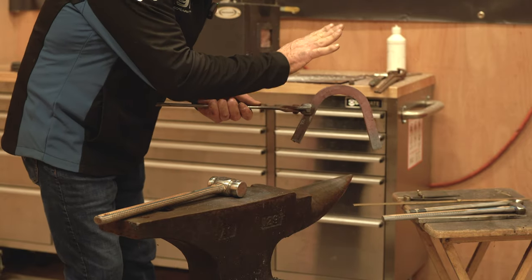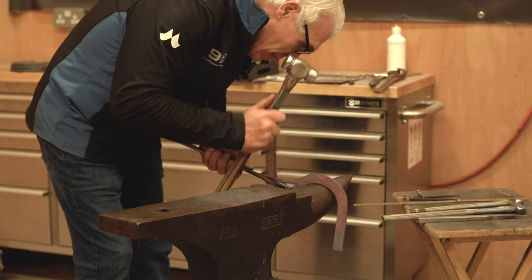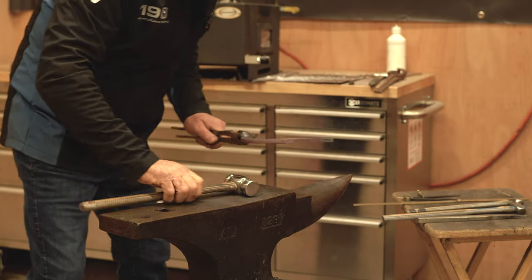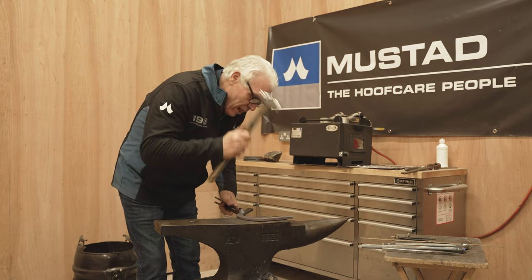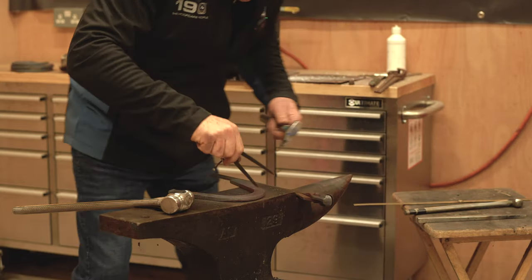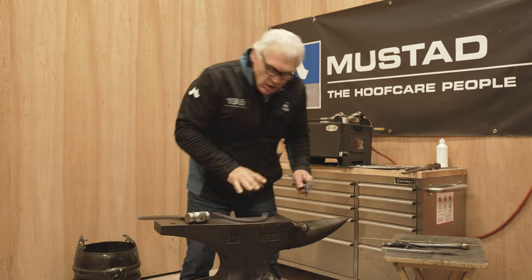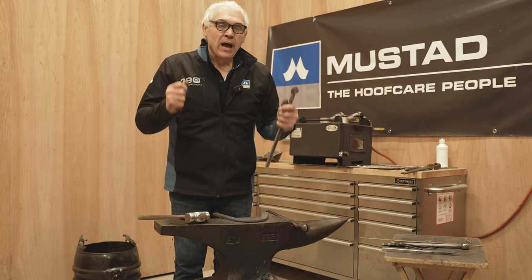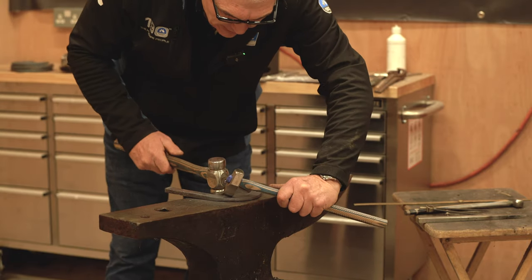When I look at a radius I see uphill on the hill and down the hill — I see my horn: uphill on the hill and down the hill. That's how I work it: up on, and away. That helps reinforce the shape and get a nice flowing shape, overlapping all the blows. I mark my fuller ring and place it — not just up the middle. It depends on the thickness of the hoof wall. If I'm shoeing a cob I want it coarser; for a light warmblood I want a slightly finer nail hold. I place my fuller ring just on the outside of center.